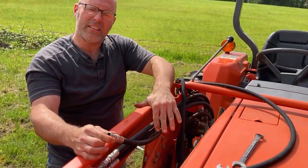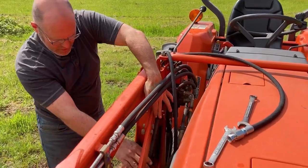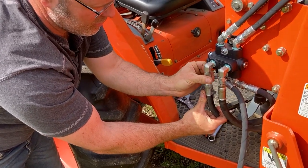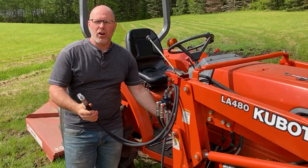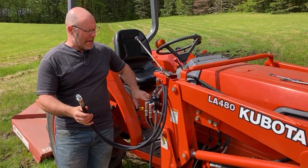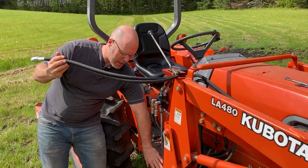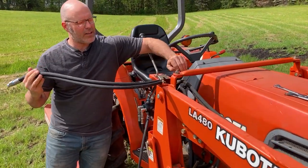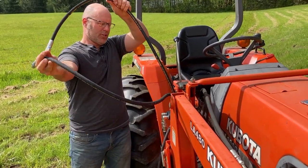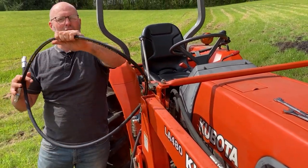I've got this hose loose. Take your time as you move these hoses around — you can get a really neat hose routing and a professional looking install. I'm going to connect it to this other port right there on the switching valve. So we've got white in the front, yellow in the back. I have the supply lines coming from the loader valve into these middle ports of the diverter valve. Now I'm going to hook the returns back up to the loader with these two medium length hoses. Since I had the white come in the front, this front hose out is going to go back to white, and the rear is the yellow. I'm going to hook up yellow first and then white.